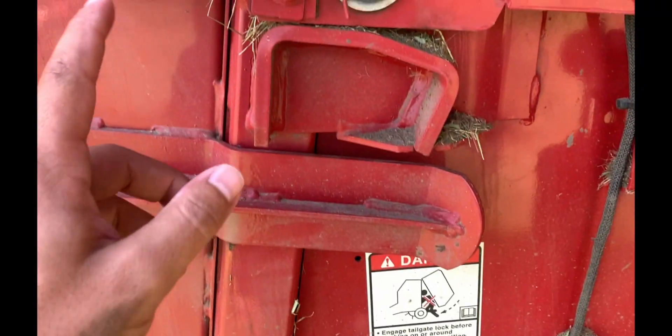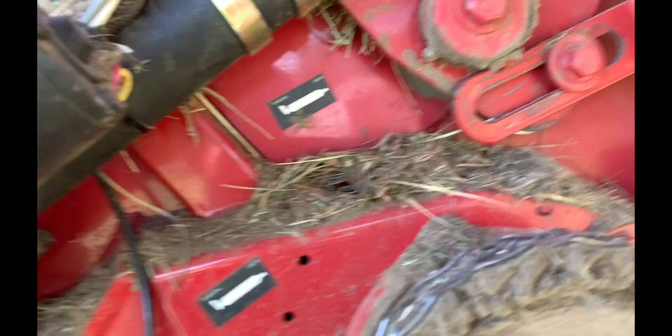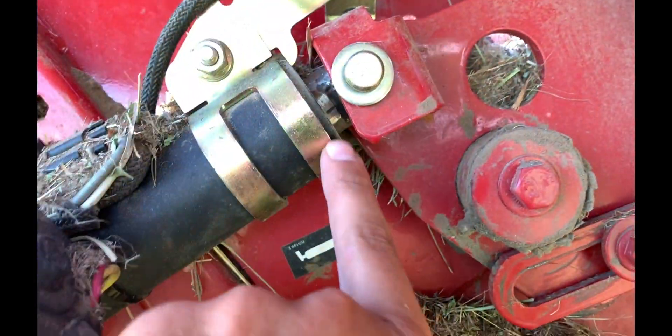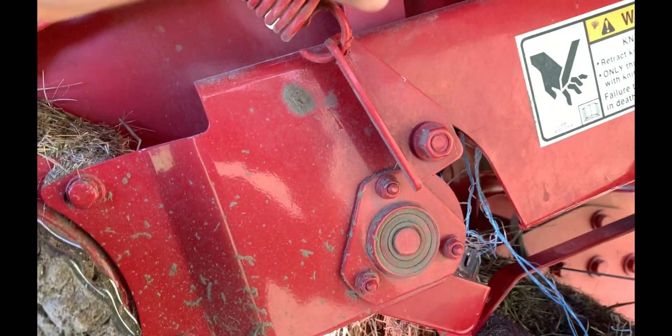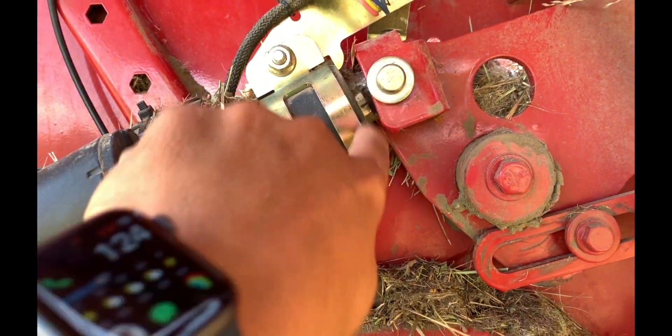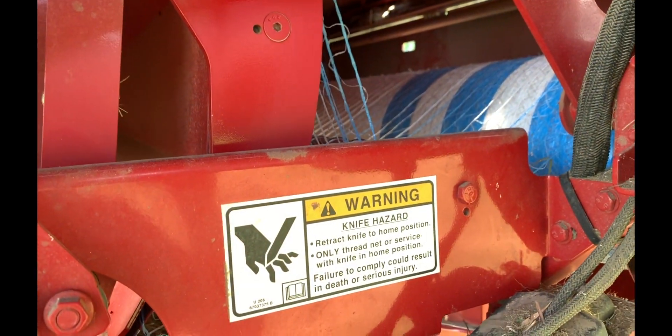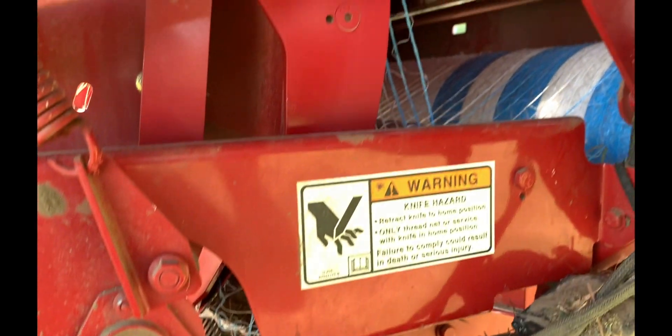We figured out what happened. I had to hit that up and it wouldn't lock. This was the potentiometer up here for the bale size — it just went bad and got out of adjustment, so you have to recalibrate it with the monitor inside. Another thing that happened was this linear actuator here that goes down and cuts the net wrap — it broke off right here and I had to have dad re-weld it. I was bailing and noticed the net wrap just kept on wrapping.